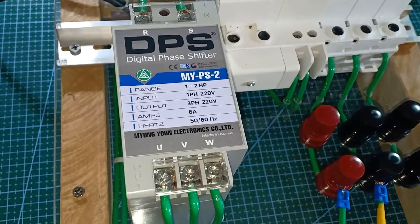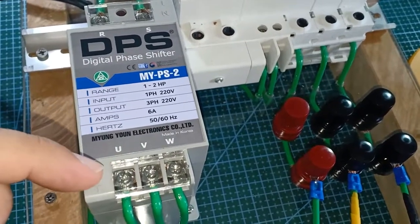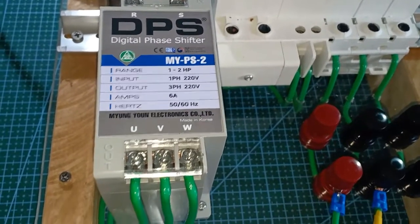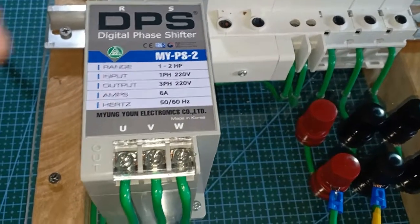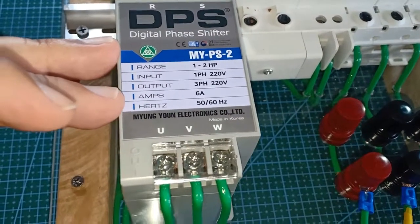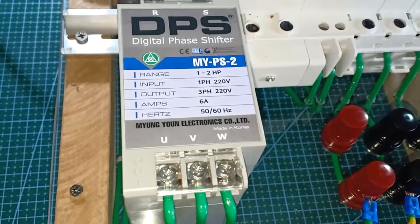In summary, for my objective of having 3-phase voltage for demonstration purposes of my electrical measuring instruments, this digital phase shifter served its purpose. It did provide 3-phase voltage at its output terminals out of my single-phase electrical outlet. My main concern about the DPS is the rather high voltage unbalance at its 3-phase output when a motor is connected but running without load. Still, if you intend to use this to run a 3-phase pump, industrial blower, or machine tool, I suggest that you need to be aware of this voltage unbalance. I recommend verifying it safely on both unloaded and loaded conditions and deciding for yourself if the result is acceptable. If you have any comments, please drop them down below. Thank you for watching.